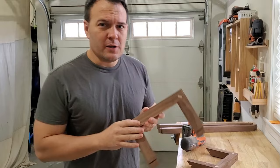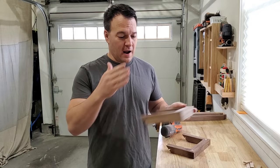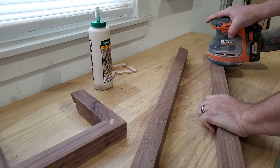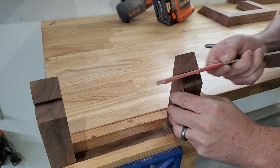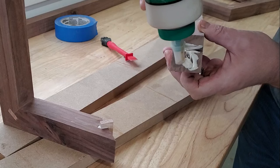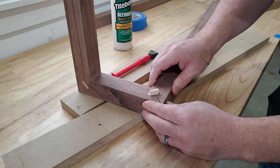Here's a tip: when doing your assemblies, try to do as much sanding as possible before the final assembly. I have a little sub-assembly right here that requires a bit more sanding — this is a perfect time to do it before I add the long pieces. I knew I still would have to do some finished sanding on the fully assembled towel holder, so for now I just sanded up to 120 grit. You should always dry fit before gluing — this spline fit too tight, so I had to sand the sides of the slot a bit before gluing. Be sure to check all of your glue-ups to make sure they are square.